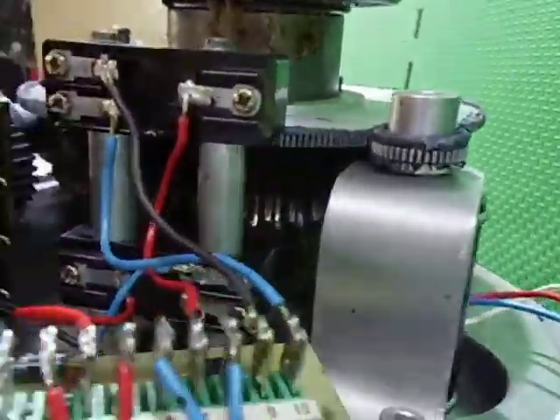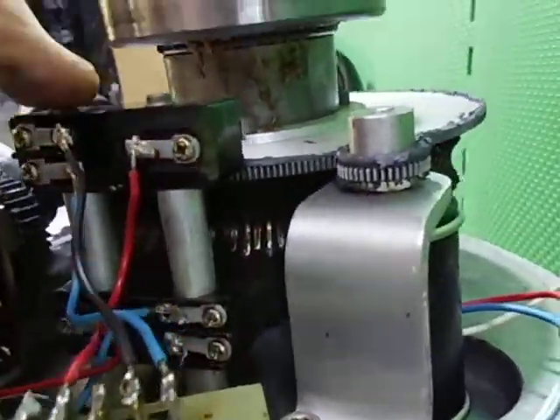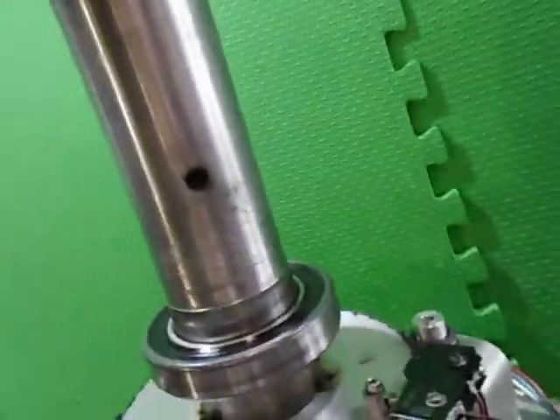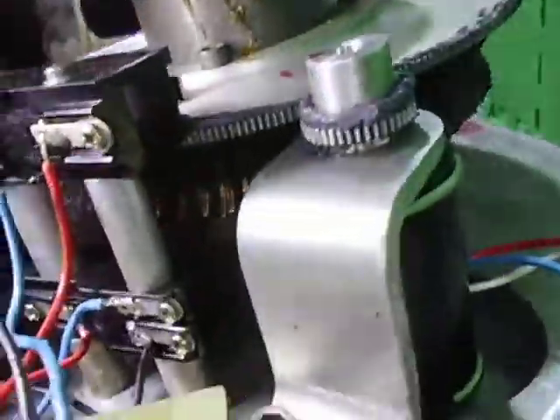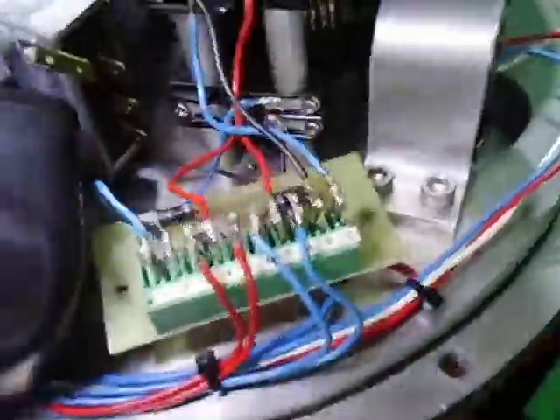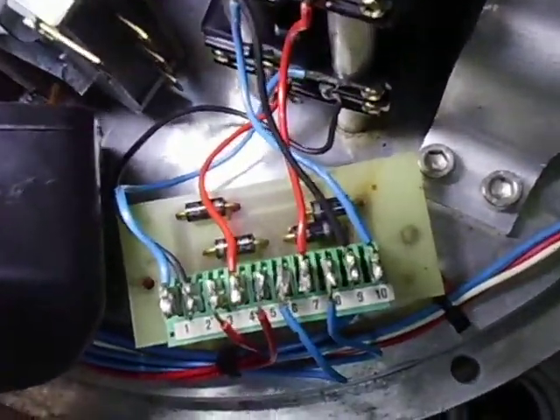I'll push this back to get it out of the road. There's the motor - it sits at a little bit of an angle, so it's obviously a motor and gearbox arrangement. Up here we have two gears - a worm drive gear here, and back over here looks like a massive bronze worm wheel. That's a worm drive. This looks like the potentiometer - look at the size of that. This thing must have about 20 or 30 turns in it, look at the length - that's the full length of the potentiometer. It's obviously a multi-wound wire-wound version, with a potentiometer drive wheel coming off the shaft and a nice big bearing.